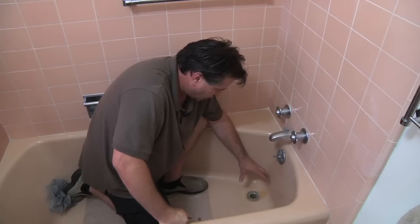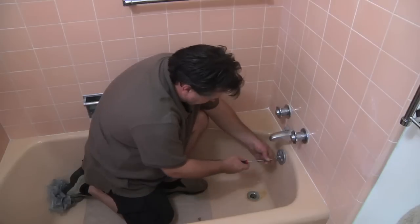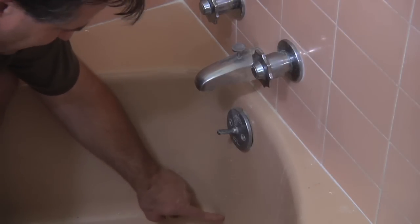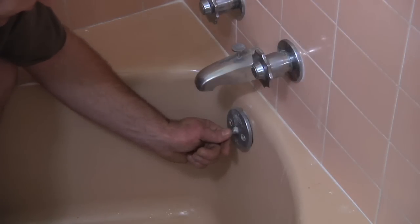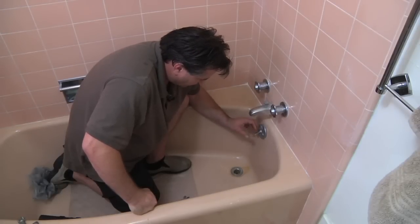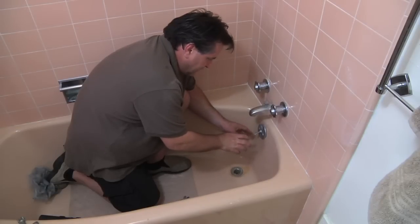If you find that that is not working, there are two ways to fix this properly. One way is, if you unscrew this thing right here and pull this out, what you're going to find is a long coat hanger-like wire that comes all the way down and meets up with the stopper down here, which is connected to this, and that's what controls it. If you find that it's not working, there are two ways to replace this. One is to go out and get a whole new stopper assembly kit and feed it down in there, and sometimes it can be a little bit of a pain in the neck.